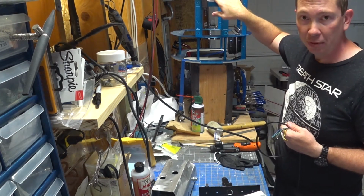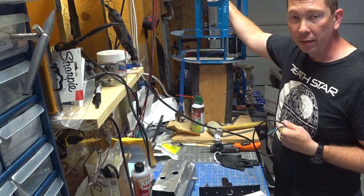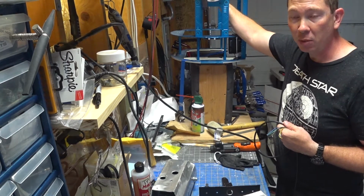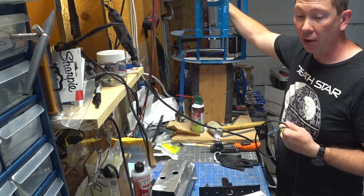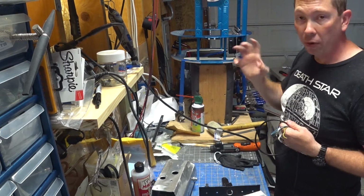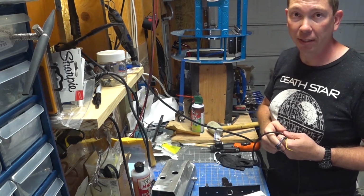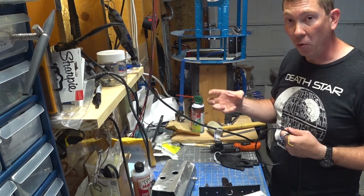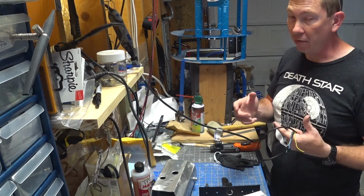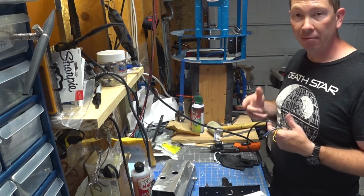Okay, we are not going to enlarge this hole on the hub shoulders. Kevin showed me a couple videos that he had of some of his pilot testing, and we want as much thickness on these hub shafts as possible in order to endure the stress. All of the body's stress is going to be directed up through those 2 points, and those are going to be the pivot mechanism. So there's going to be a lot of energy going into those, and the more we take away from the thickness of those tubes, which Kevin is manufacturing himself out of solid aluminum bar, that's problematic.